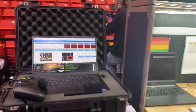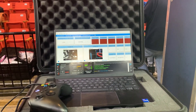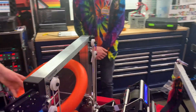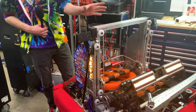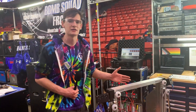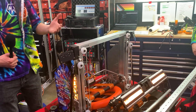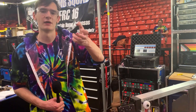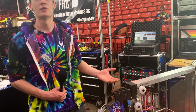We can take a look on the screen — there's a nice box around the note, it figures out the center, and drives the robot towards it. We've also got two Limelight 3s up top as part of our aiming system. We encountered issues with our previous vision system which just had one camera on the front, so we greatly increased our field of vision. This allows us to set up full-field localization, meaning if we ever see any tag on the field, we know exactly where our robot is — allowing us to shoot from really far away, really accurately. We also encountered ambiguity issues with AprilTags, where they'd flip depending on how straight-on we were looking. Having more AprilTags at our disposal lets us choose the best data and get the most accurate shots.